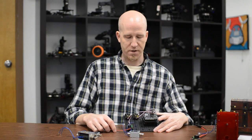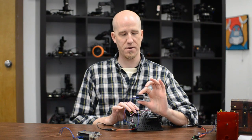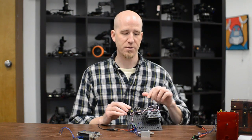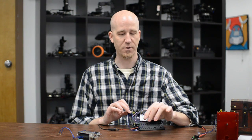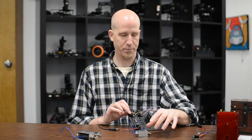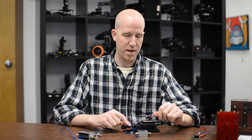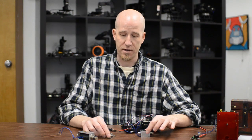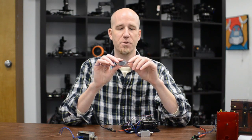Our demo code is very simple. If you're holding down the first button, as long as you hold it down it will actuate the solenoid. On the second button we've added a two-second delay, so if you hit it once you can see it actuates for two seconds. So that's how it's done — you need a separate power supply, you need a relay, and then you can actuate your solenoids. They're great for all sorts of latching projects, they're fun to play with, and they're a cheap and simple solution for small in-and-out actuation rather than using DC motors or expensive servos for the same sort of project.